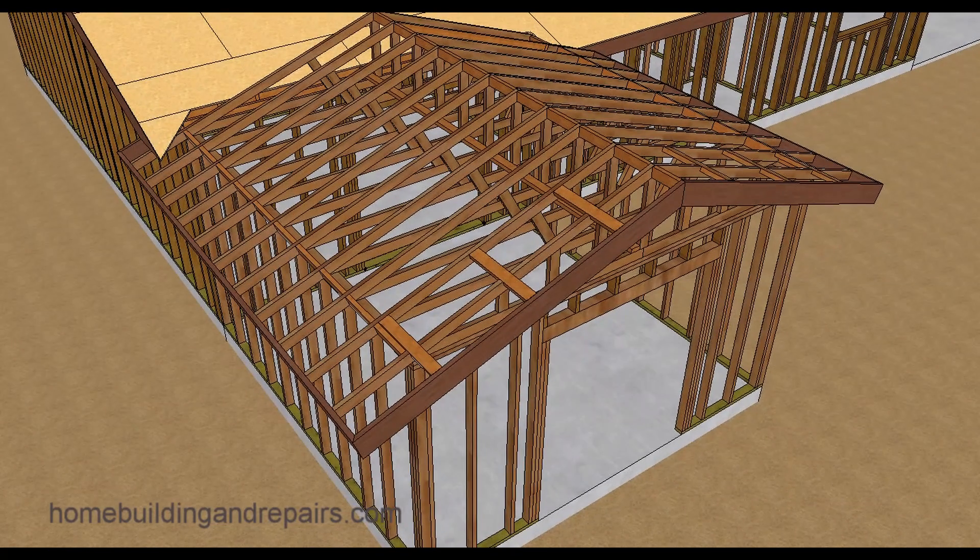Let's look at roof trusses for a gable. You can get hip roofs and all sorts of designs with engineered roof systems, so it wouldn't be a bad idea to check out different designs. It's really not that complicated — a lot of the instructions are simple. I broke this down to where you have a flat straight gable roof with nothing on either side. This is one section — you would order these trusses, and the fill area you could cut in yourself.